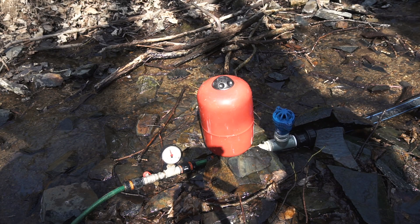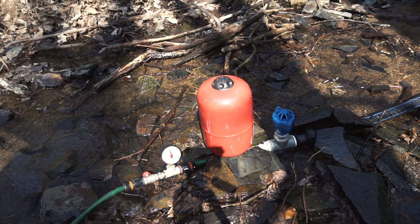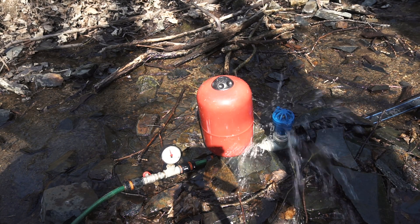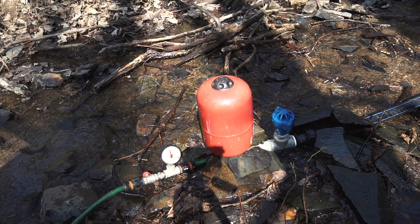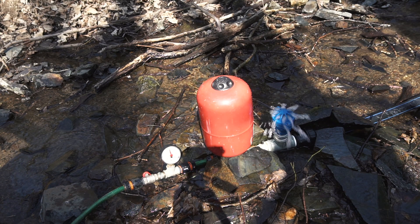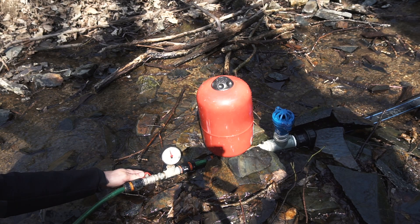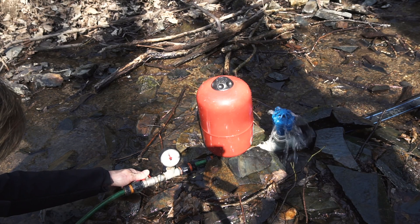The pulse of the ram pump is a little bit faster in comparison to my custom valve, but given that this valve is almost stuck and with no hassle, I think it's a good result — we have almost 3 bars here. Now it's time to send the water upstairs and see how much water we get up there. I'm opening the valve — let's see the pressure — the pressure will go down.